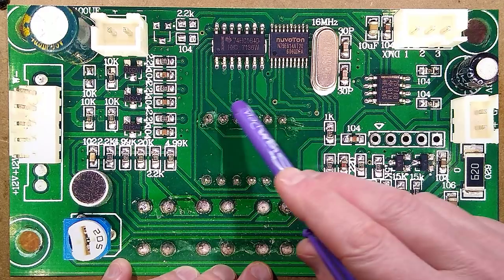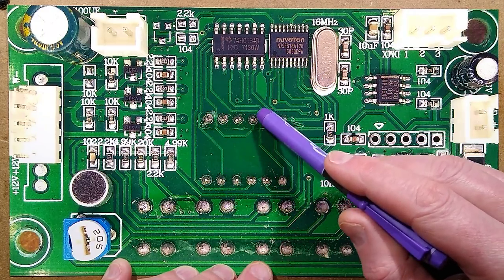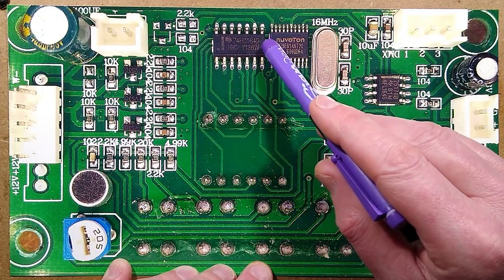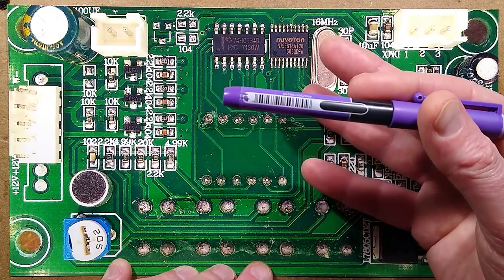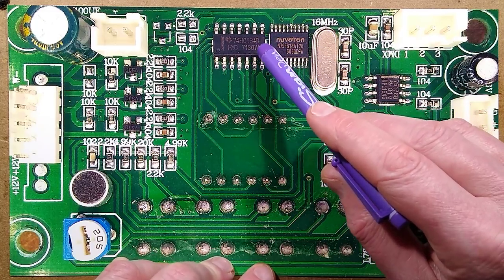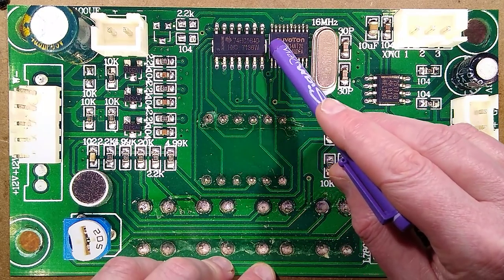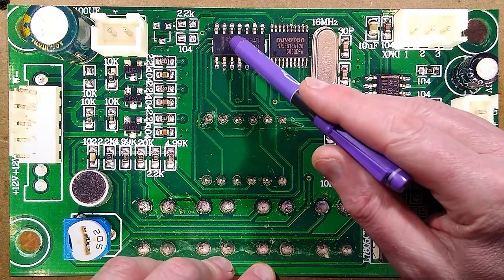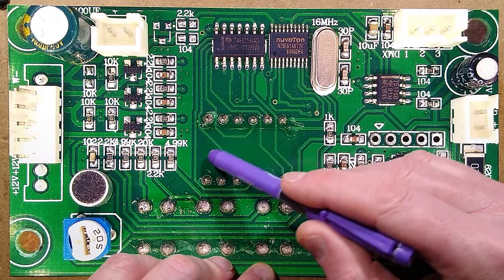And the purpose of that is that when it's driving the displays here, the microcontroller controls the digits directly, but it moves data out using just a clock and data into this. It just saves pins. They've really economized in pins, as this will unfold as we go on. So say, for instance, it wants to display the number 7 in the first position. It will load the data out into this that corresponds to which segments will be lit for the number 7. They go to the segments, and then this enables that one digit then to display the 7.